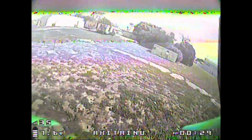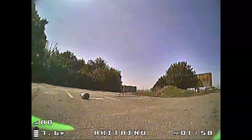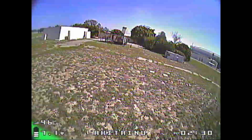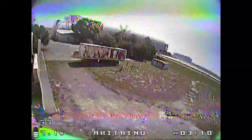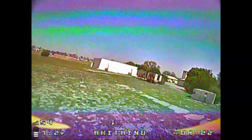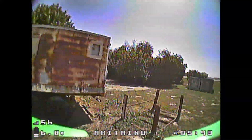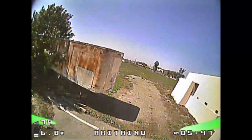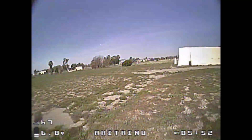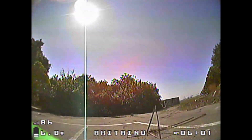Here's another flight with the new motors on, same battery — the 650mAh 2S — just kind of cruising around, throwing a few flips and rolls, to get an idea of the efficiency of this new motor. It's clearly obvious it's much better than the 1106 motor on this exact same setup. At about five and a half minutes, the battery is just lasting forever — I'm still at 6.9, 6.8 volts with no voltage sag coming on. I figure if it's lasting six minutes versus the three minutes on the 1106, that's a good enough test to know this motor is more efficient.